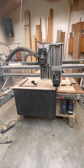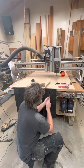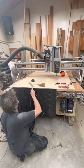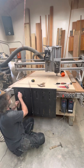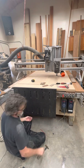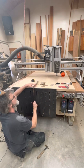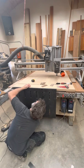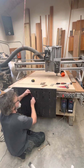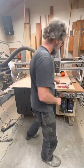So now I just need to square it up in relationship to the bed. I have some shims, some little wedges to stick between the bottom edge of the T-slot there. We know the top is already where it needs to be. The bottom needs to kick out all the way down at the bottom about a quarter of an inch. Halfway up, it's an eighth of an inch; half of that is a sixteenth of an inch. So we're probably going to bring it out about a 32nd of an inch, more or less — and that's right at the bottom of the rail. Even with those two screws being only two inches apart, it will work pretty well.